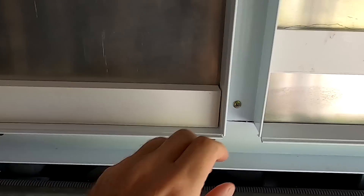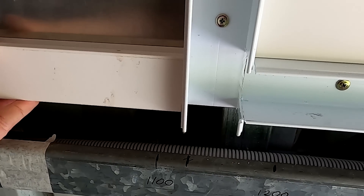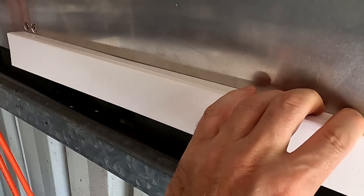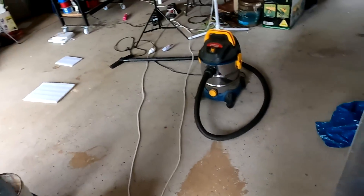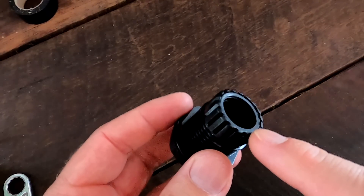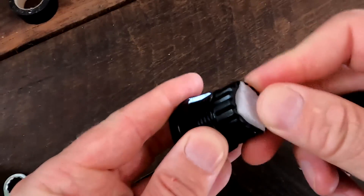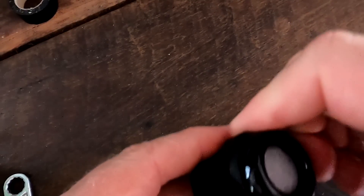I've now decided to use the same duct for our DC cables as well as for our data, communication, and control wiring. These will all go in the same duct. I'll continue this smaller duct down here with a cutout over there to separate the data cables further. And I'm going to show you something — we can actually use a PG-25 and use this rubber foam square, just squeeze it in and bang, it's closed.